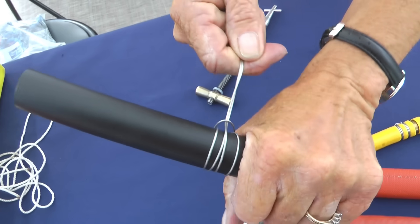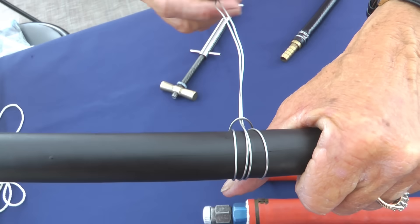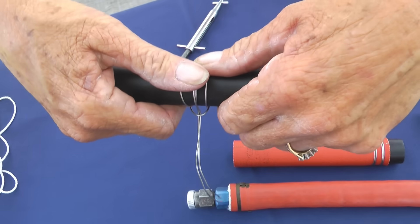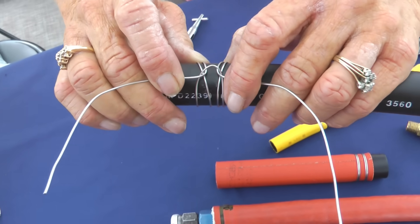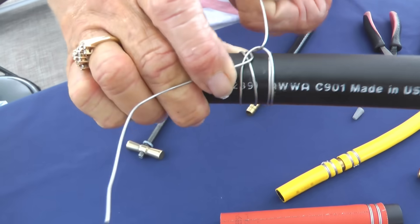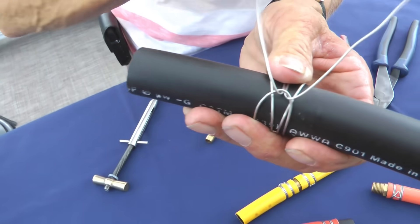Snug up on it to take the slack out, then take the wire nut off. Walk it around to make sure nothing is twisted — if it is, walk it up and out. You want everything on its respective sides. Then take these two ends and put them up into a V.